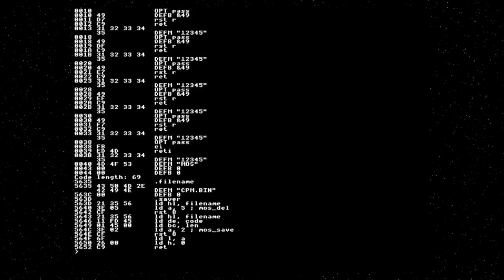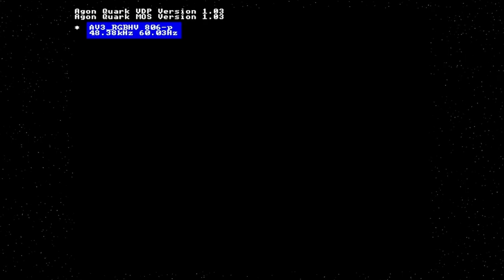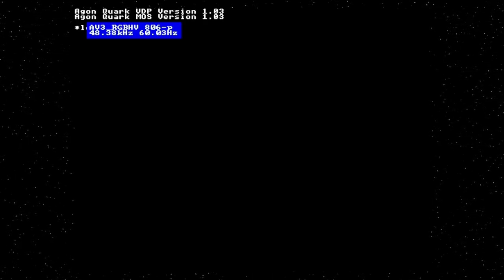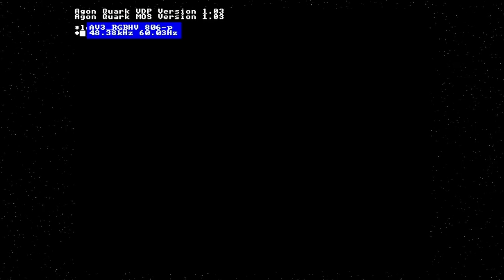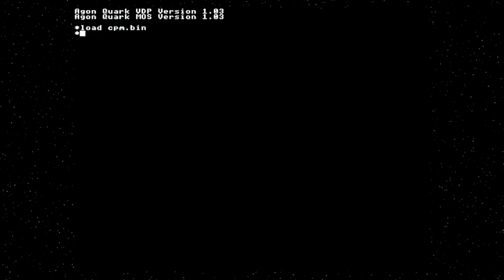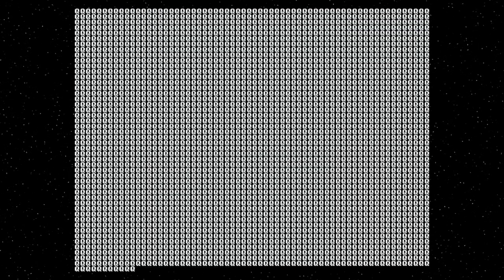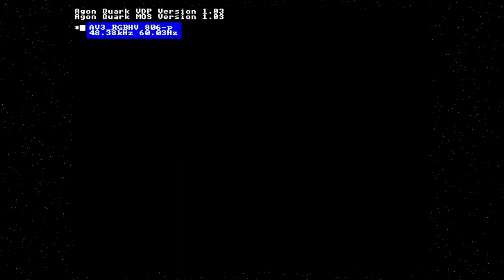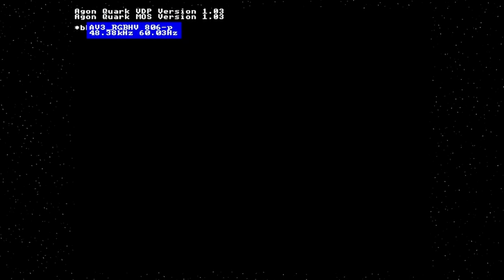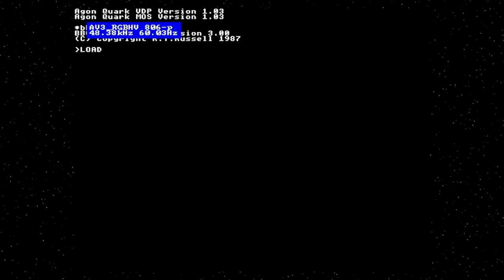To call a system call, I use the inline assembler to produce a chunk of machine code. I run it, it assembles and saves. I hit the reset button to get back to the prompt. I load it, run it — we get Qs. So now we should try and put some actual program into our program.